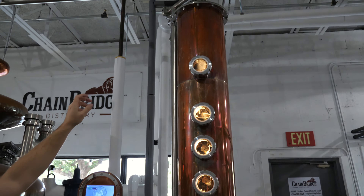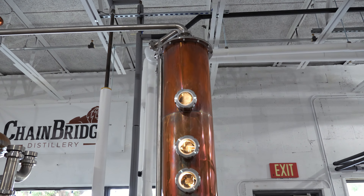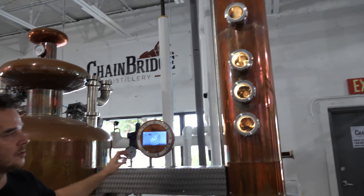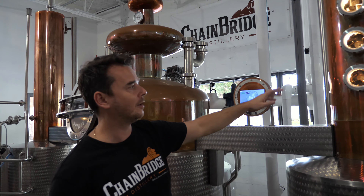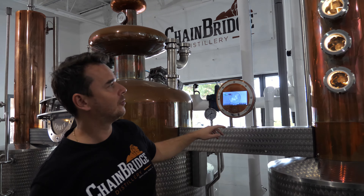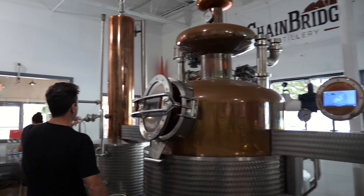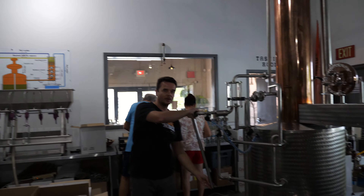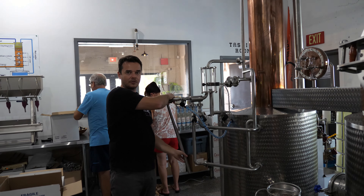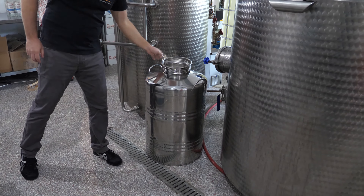As you're heating it, the alcohol starts evaporating — the vapor rises through a pipe and goes up the reflux column. On the top we cool the vapor down so it becomes liquid and slowly drips back into the mash. Our distillation runs are really long — 12 to 13 hours. We run it through the reflux column many times to purify it. There are different plates that we can adjust for different flavor profiles. Eventually the purest vapor escapes through the vapor pipe and condenses back to liquid.